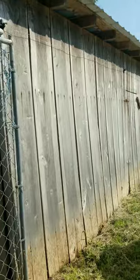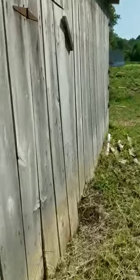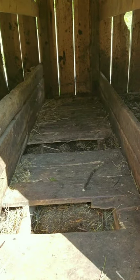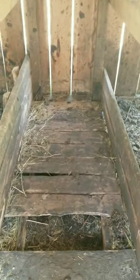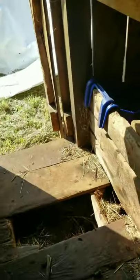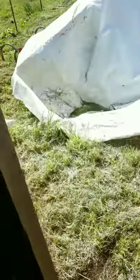We'll get down here and you'll see we slanted the roof just like the other building. I call this the front but it's actually the back. We have a door and we throw hay into the middle of this chute — there are two stalls on each side. Those blue bins are feed bins. This is built out of sawmill lumber and it's a nine or ten year old building that needs some boards replaced. Do not get poplar wood — horses will eat poplar boards down and you'll just keep repairing. Oak is best if you can find sawmill lumber. They don't come in there a lot right now because they've got row hay outside, but we stack round hay bales in there and they'll eat on it for several days.